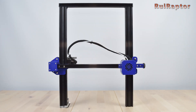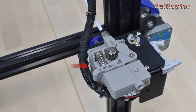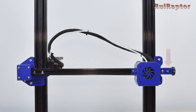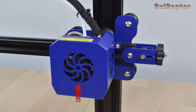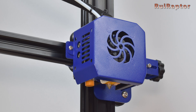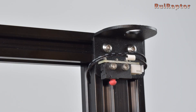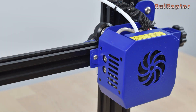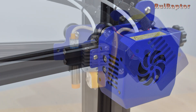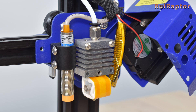This is the top half. All the blue parts are made from metal. The extruder on this one is a single geared one. There's also a filament run-out sensor next to the extruder. At the right side, we can see a belt tensioner for the X-axis belt. On the print head, a couple of fans — one for layer cooling and one for cooling the hotend. There's also an inductive sensor for bed leveling, together with an end stop at the top of the Z-axis. The lead screw comes not installed and was packed inside one of the vertical profiles. The hotend is an all-metal with a bi-metal heatbreak and steel nozzle.